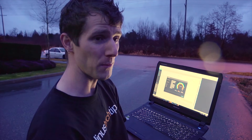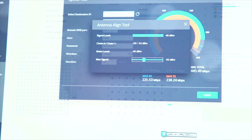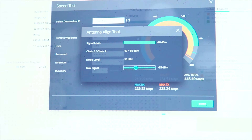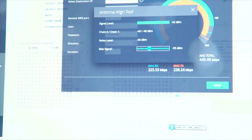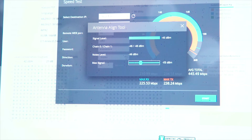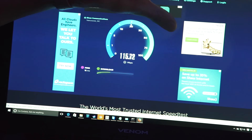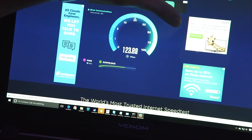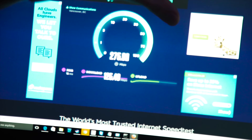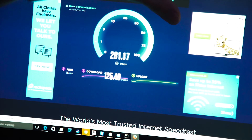With poor alignment at the lowest possible output strength, we are still seeing about 200 megabit per second up and down - and that's with Ed standing right in the way of the antenna. Inside the building you had to make pretty big changes to dish alignment to really affect things, but here I'm barely even touching it. Way down the road, we're still enjoying speeds that were pretty much the same on the downlink, and actually running a little faster on the uplink.